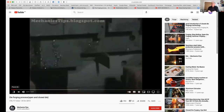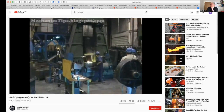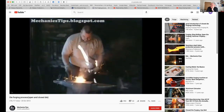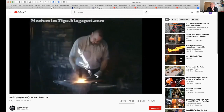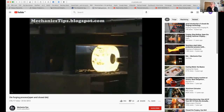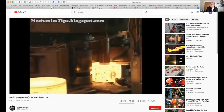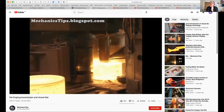Use of compressive forces. These forces are applied through tools and dies, driven mainly by hammers, which deform the workpiece by high velocity impact, or presses, which deform the workpiece through controlled high pressures. Forging is one of the oldest metalworking processes, dating as far back as 8000 BC. It is utilized today to reduce the cross-section, improve the metallurgical microstructure, provide directional grain flow, and eliminate porosity of cast ingot in fabricating wrought mill forms, and to form discrete parts to near net shape from these wrought mill forms, further refining microstructure and directional grain flow.